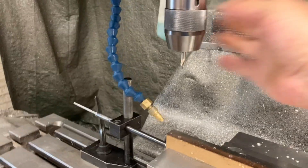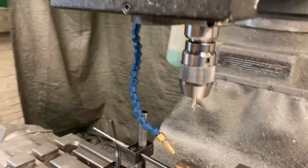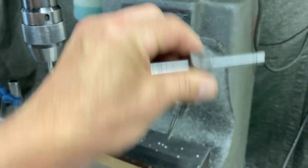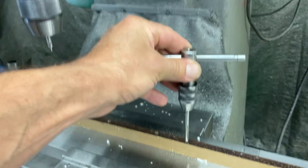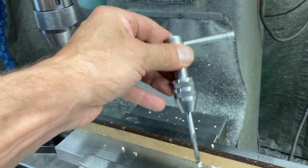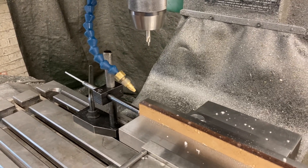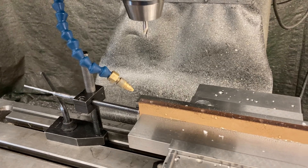When I tap them by hand, I take the tool out, put a center in the spindle, and then use a T-handle tap wrench with a center in the top to support it over each hole. I zero my DRO, tap it a half inch deep, whatever — by hand. And I keep the spray mist on it, there again, just to try to keep it from heating up. There could be better coolants for plastic, but that's what I got, so that's what I use.